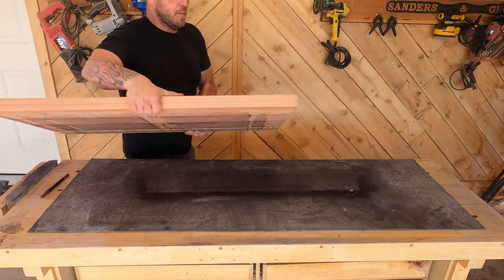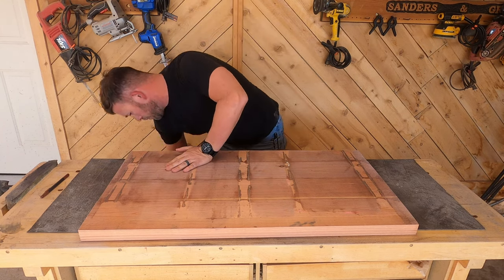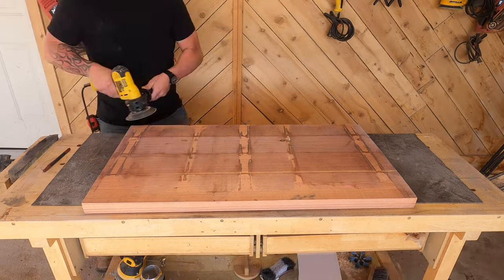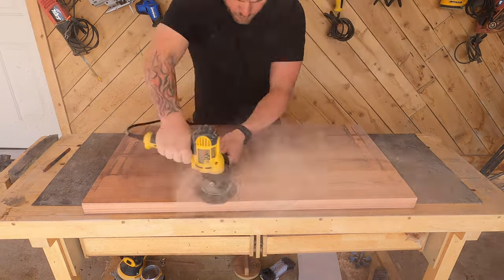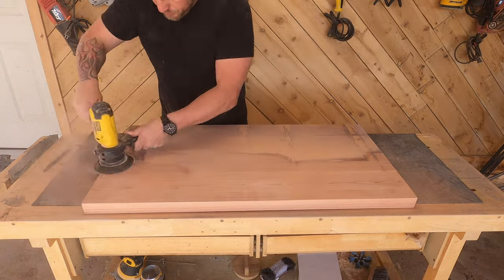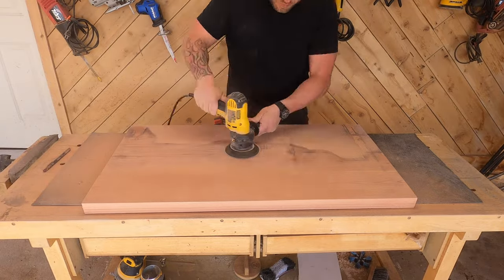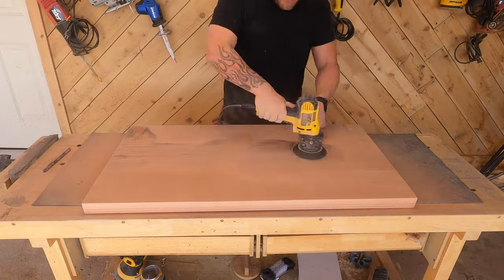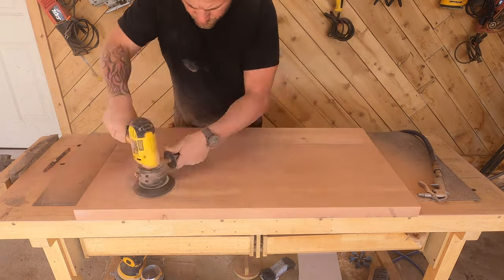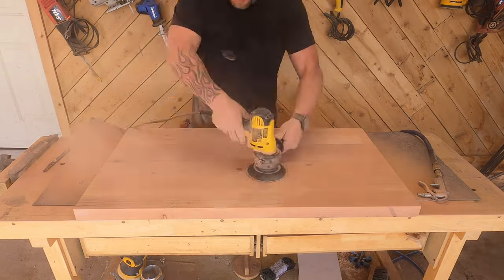This is a piece of redwood that we glued up probably over a month ago and it's just been sitting in the cave, which is where all our material is. The problem is this is only about 18 and a half inches wide, and because our artwork is in a perfect circle, that's as big as we could do it. So we decided to just make a little end table out of it. I surfaced this thing down top and bottom — it's important when you surface a piece of wood that you do the entire thing, so you can get an idea of which side is best.